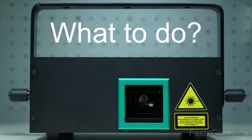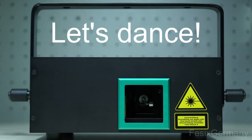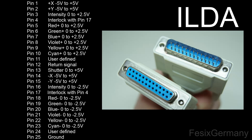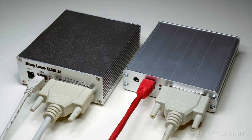Additional safety features are a key switch and a remote emergency switch the supervisor can use. Many cheap laser projectors can be controlled by the light protocol DMX, which can tell the projector to display pre-programmed frames or apply different effects. Sound-to-light functionality can also be found in those cheap devices. The international standard for connecting laser projectors is the ILDA interface, which is a 25-pin D-sub connector — not to be confused with the old-style LPT port — and has differential analog signals for controlling up to 6 colors and the X and Y position. Most projectors have an input and through connector so multiple lasers can be fed with the same information. To get these signals, a dedicated DAC or digital-to-analog converter card is needed.